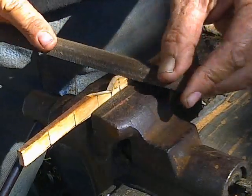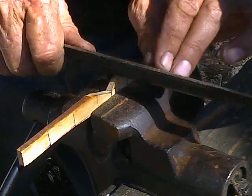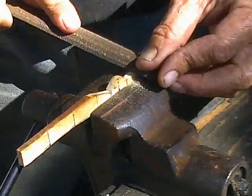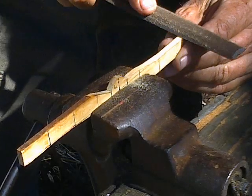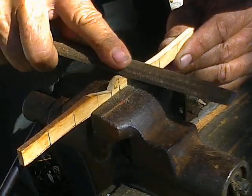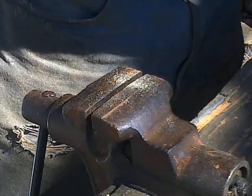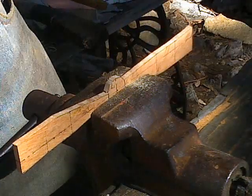Just a little bit deep there. As I also said to Mike: the more work you put in at this stage — bringing your laminate right down to the line before gluing them together — the less work you have to do to achieve the same aerofoil and get it to balance. It's just like taking the time to balance the planks before you decide which end of them is going to be at which blade tip. The actual carving is probably the quote 'sexy' part.